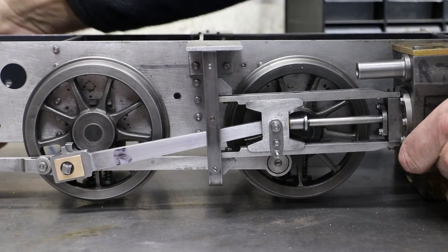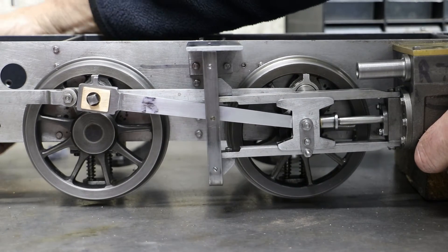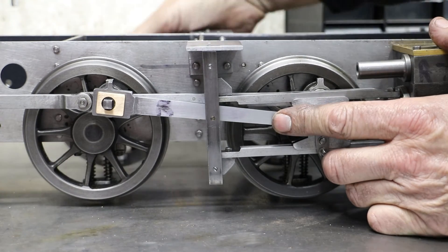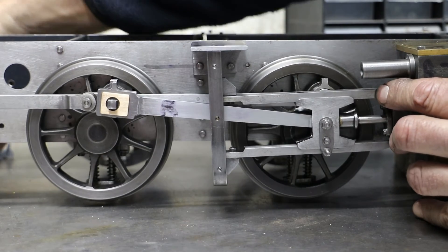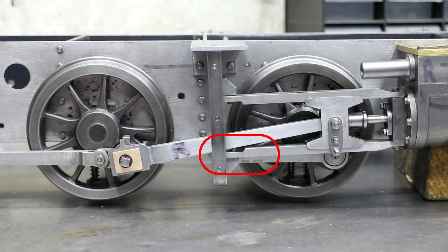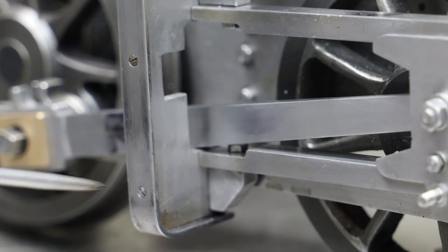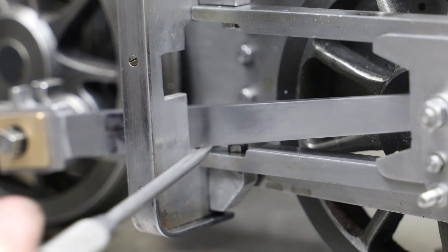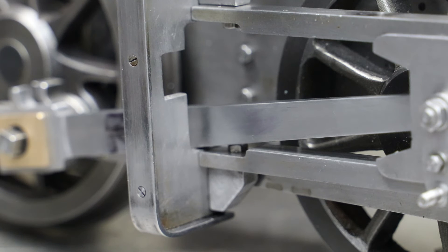Here we're looking at the right side of the engine with the right hand connecting rod in place, fitted at the big end onto the driving wheel crankpin, and at the small end into the crosshead. As I rotate the wheels there is a bit of a tight spot here — not really a surprise, so not a problem. But as I get to this position, the connecting rod starts to foul with the bottom slide bar and the motion plate. In this view, the frames are up on blocks, so the wheels and therefore the rods are all at their lowest point due to the suspension pushing them down. But I can confirm I do get the same issue on the top side when the suspension is loaded.